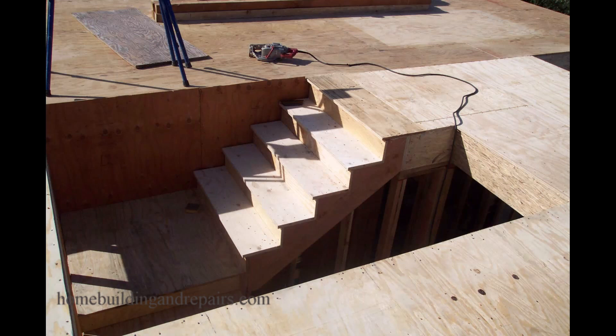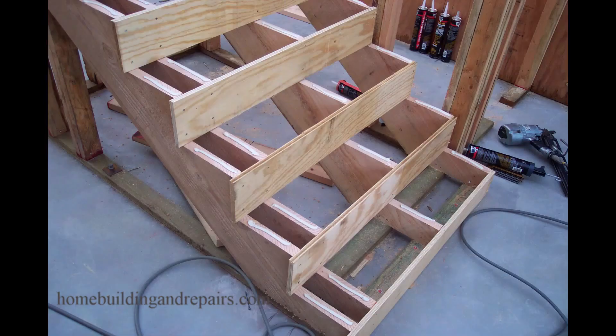I wouldn't doubt if it was actually a mistake because I have also seen jobs where we have a footing underneath the bottom of the stairway. So to answer your question, I've never done a job repair or heard of any job repairs necessary for a stairway that did not have a concrete footing underneath the bottom of the stairway in a home with a concrete building foundation. However, if this is a concern of yours, contact a structural engineer in your area or install a concrete footing underneath your stairway. If you're going to install a concrete footing, make sure that you have anchor bolts for the treated lumber that will be used to attach the stairway to the concrete foundation.